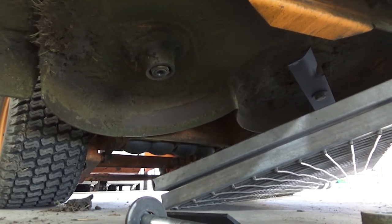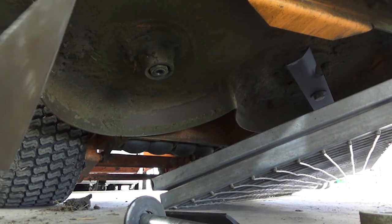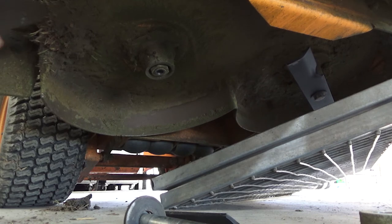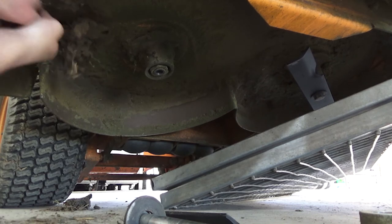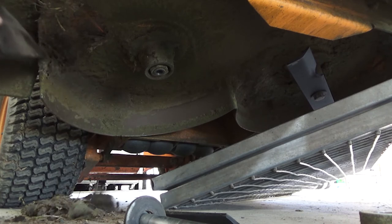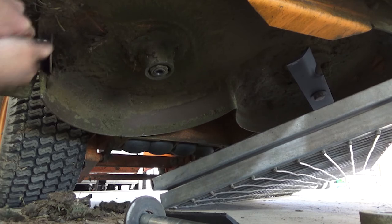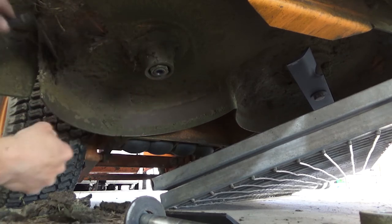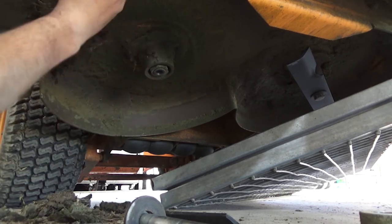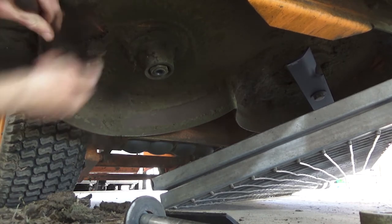All right, just how dirty that is, okay? Not ideal. Gonna give it a quick scrape out now. See how it looks. Might even get it up and under and pressure clean. Just a lot of gunk. Not what you want, okay? I was concentrating on the blade change, and I've got over this side and really noticed it, shining through even on the other side there. So grab yourself whatever scraper you've got, get rid of the bolt, clean it right up.